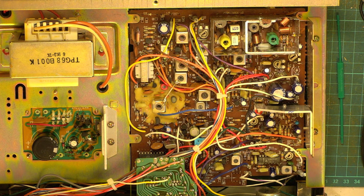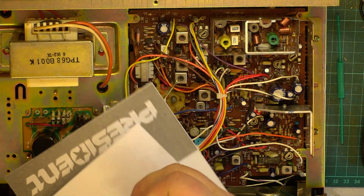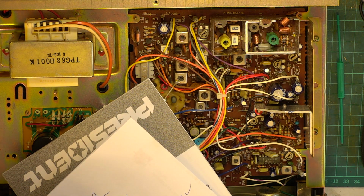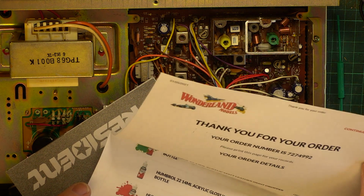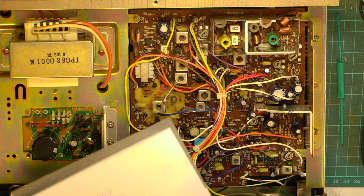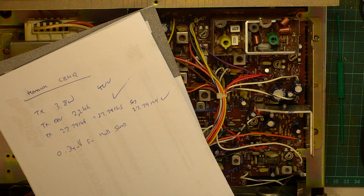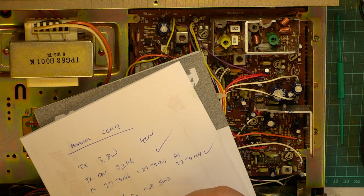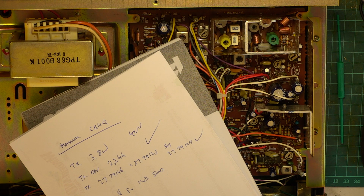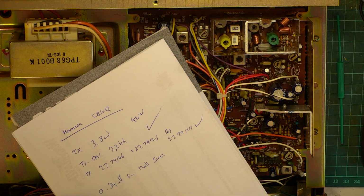Let's get a new reading then for the Sinad. So, 4 watts. That's correct. That's done. So we'll get that back to 12. Okay, it has improved. But you know, we could... I mean, because it bounces around, I'm now reading 0.24.